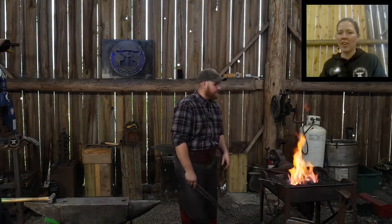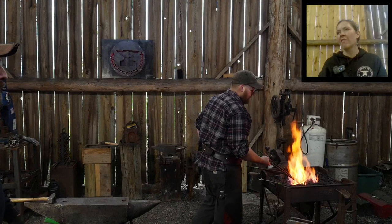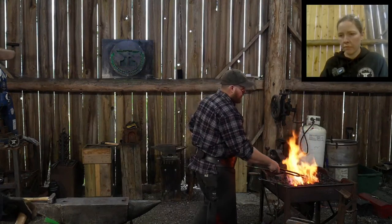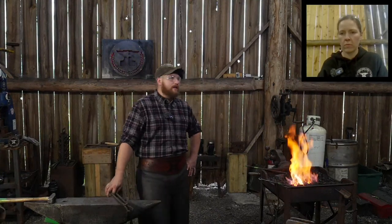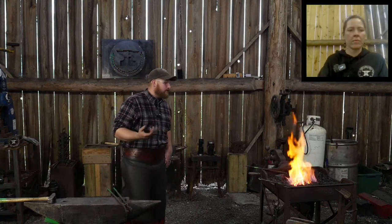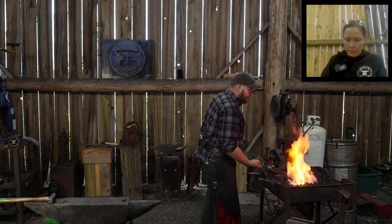Let's see, Christopher Fay says, any advice on how to use a 25 millimeter hardy hole as a 12 millimeter hardy hole, how to convert it or something? I think the Chio has a 12 millimeter. That's why he was asking. So how to adapt a hardy hole, to make it bigger? You can adapt them down smaller, but you can't make the hardy hole bigger without physically grinding or removing material out of the hardy hole. To take the hardy tool itself, you can always grind it down to fit that hardy dimension. That's really your only option: cut away material, grind it down till it fits snug into the hardy hole. Another thing you can do is forge it down, if you want to reharden and heat treat the tool. If it's made out of mild steel and it's a hardy tool, it doesn't matter. So that part's kind of up to you.